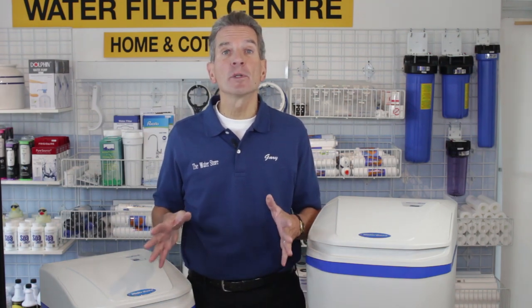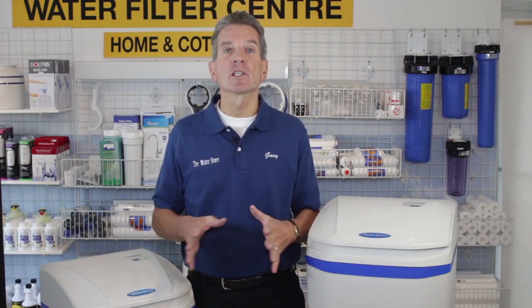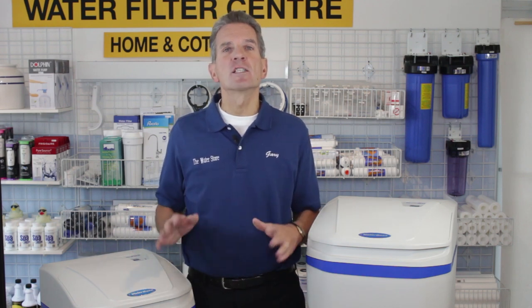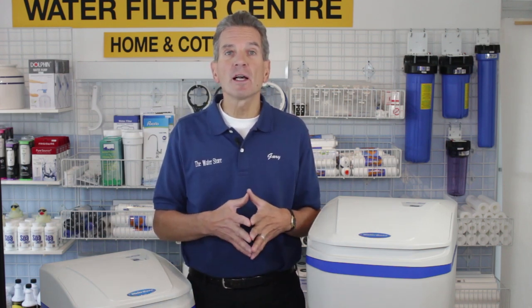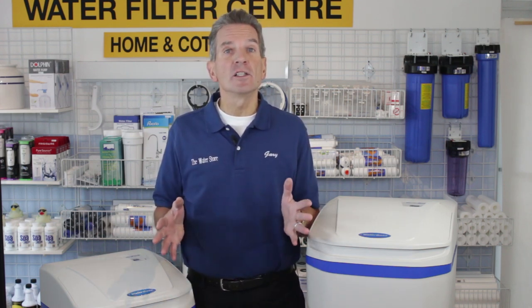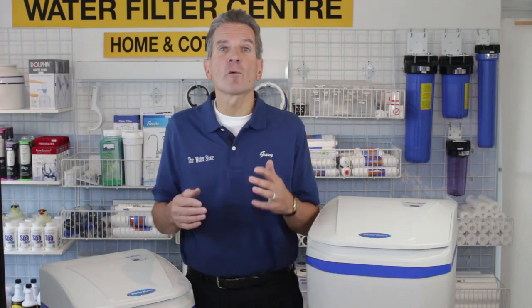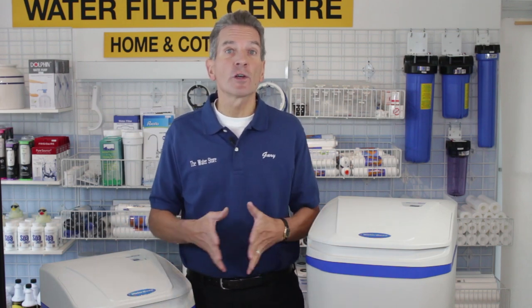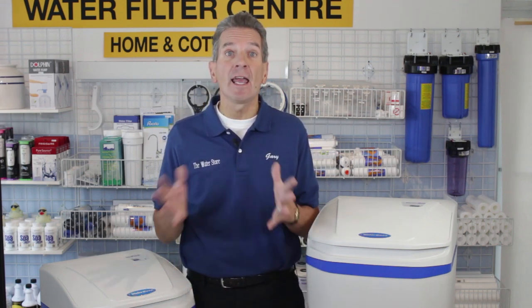When it comes to reliability and build quality, I give these 9 out of 10. These units are fully manufactured in the United States and have been doing this for a very long time — they're extremely reliable. The only thing I caution folks on is: because they are a high-efficiency water softener, if there are only a couple of people in the household and the water isn't used all that much — maybe it's a seasonal home — keep the salt level very low in the reservoir so that salt turns over. And especially if you're using potassium chloride — and this goes for any water softener — keep the potassium chloride levels low because that tends to clog very easily in any water softener.